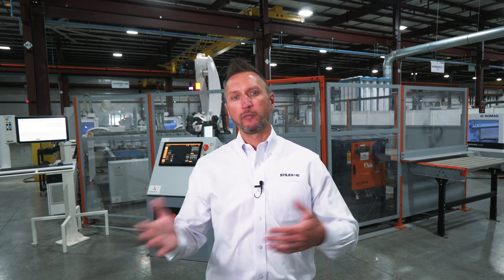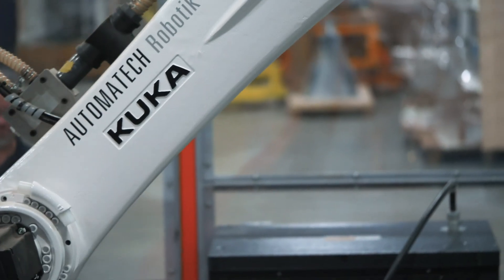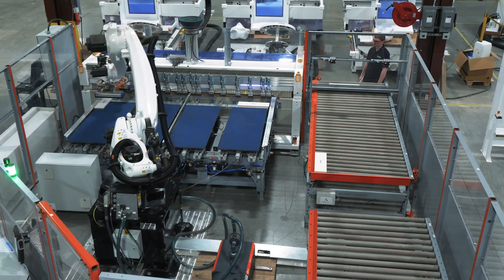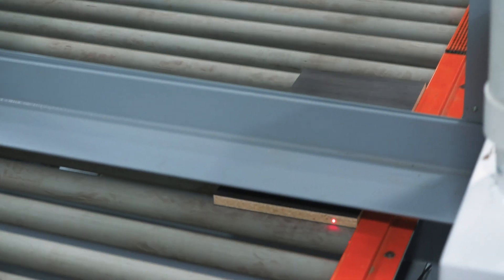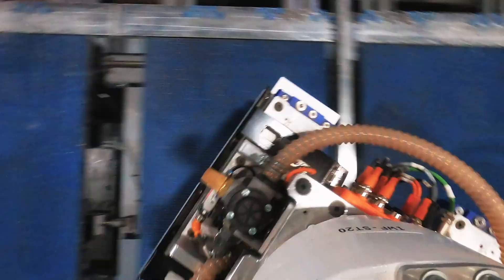The operator moves a part from one end of the machine to the other, goes through the mundane process of opening a file, opening a program, actuating a program, pushing a button or stepping on a foot pedal to start the machining cycle. In the worst case, the operator sits waiting for parts from an upstream process. With a solution like this, those waiting cycles are minimized — the program is automatically called up by the barcode system on the machine. The robot moves the parts consistently through the dowel insertion machine at the same rate every single time, driving the effectiveness of the dowel machine upwards of 90%, from the 60% we typically see in a manually operated system.